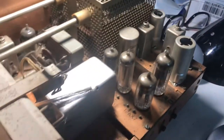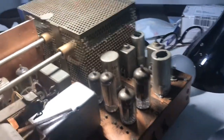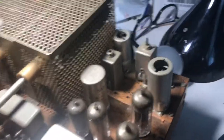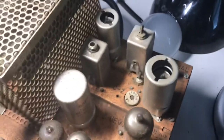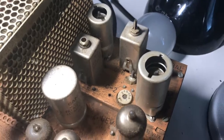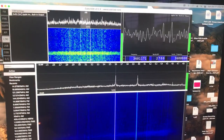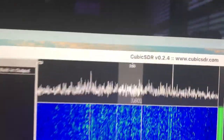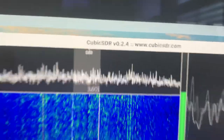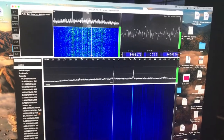This gives us a pretty good way to show people how to adjust the carrier knob and the sideband frequency. The best way I found to adjust these is to get an SDR running — a cheap RTL SDR dongle running with CubicSDR software. I'm running this on a Mac iMac, and with that running it's pretty easy to get this Drake up and running.